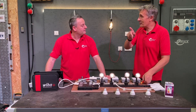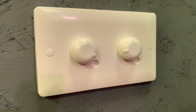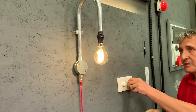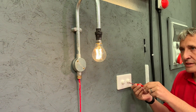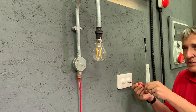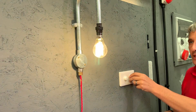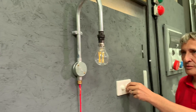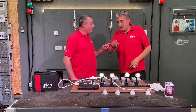MK have solved that with this product. It's a simple innovation — let's put the low end potentiometer on the front panel. So you just adjust that with your screwdriver? Yeah, you don't have to remove it, you don't have to twiddle the switch 20 times. I'm going to do it now — you can see it's dimmed nicely and smoothly, but personally I'd want the lower end setting on there. I'll just twiddle that with the screwdriver — you can see that comes down. I can dim to off, but personally I just like to leave it at the lowest spot and set a glimmer of light there. Then I can dim it nice and smooth back down, turn off, turn it back on again and we're at that level. I think I could instruct somebody over a phone on how to do that.